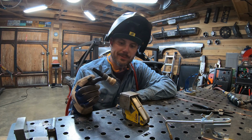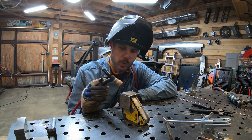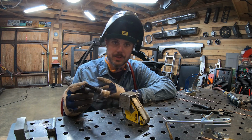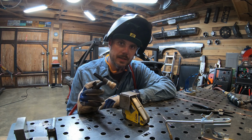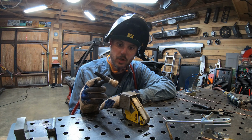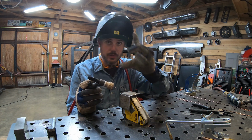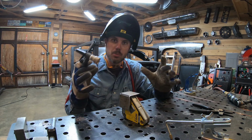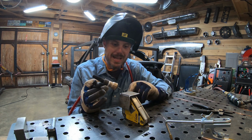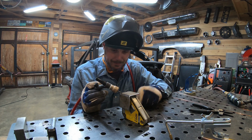Even whether it's a tack weld or a big long normal weld, what you're waiting for is, unlike MIG welding where you pull the trigger and you start flowing metal, you've got a lot of amperage control. You basically just barely start your current, and then you ramp up with your pedal until you find this molten puddle, until the little T1000 puddle starts to move around a little bit and you can see it very clearly. That's when you can add your dab. On tack welds like this, it takes very little, especially because you're here on the corner and there's not a lot of room for this heat to escape.